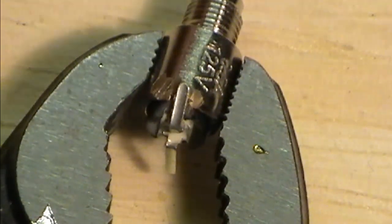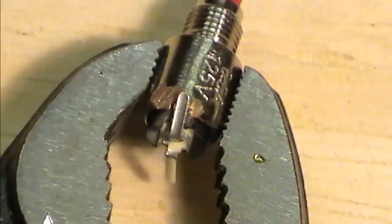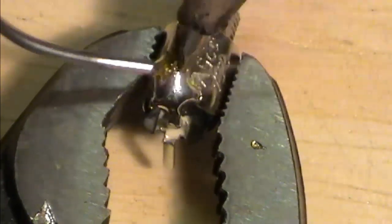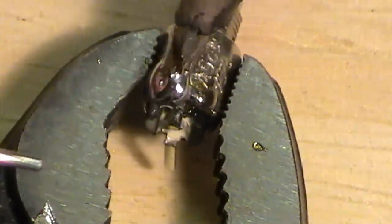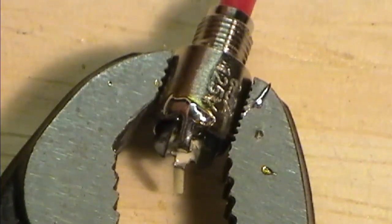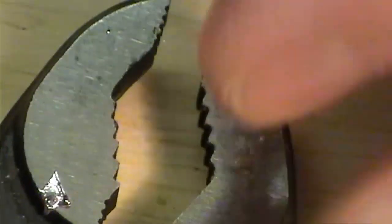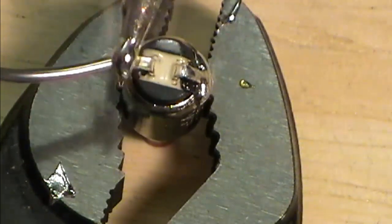And what I want to do is literally just now solder, I've got shaky hands today, solder the top. So just solder that pin and solder it to the body. So my pin is soldered to the body of the mic. I'm just going to flip that out the other way, bearing in mind these are hot. Put a dab of solder on the top pin there.